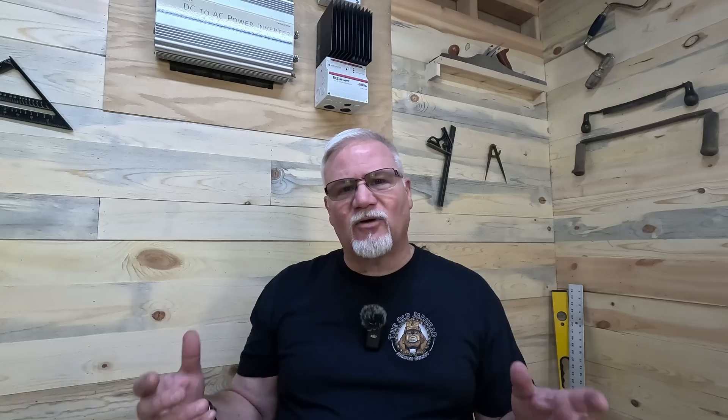This is important because solar panels produce varying voltages and amperages depending on the sunlight. If the sun is hitting the panel perfectly, it should produce the voltage it's supposed to produce. Although if it's really cold out, it might actually produce more voltage, and if it's really warm or hot out, it might produce less.